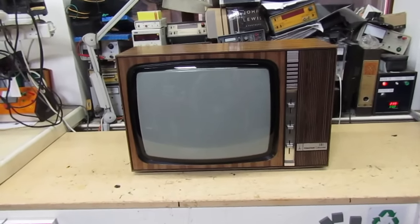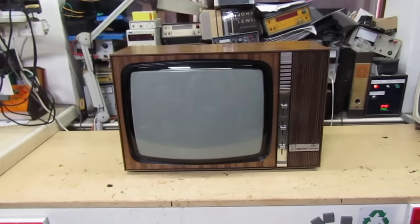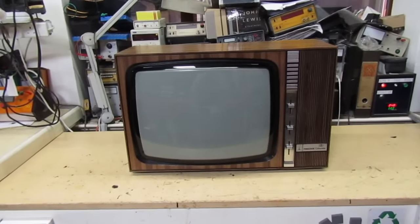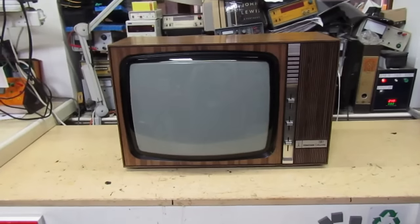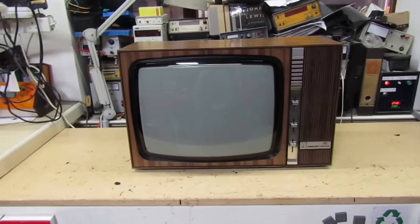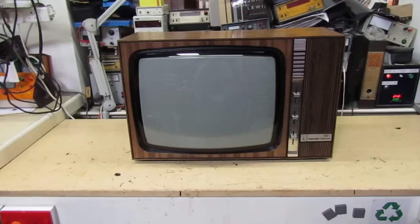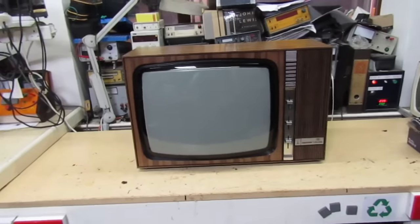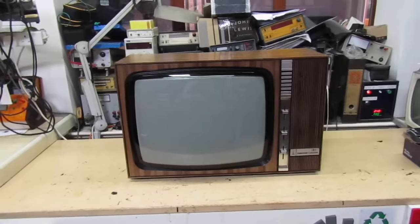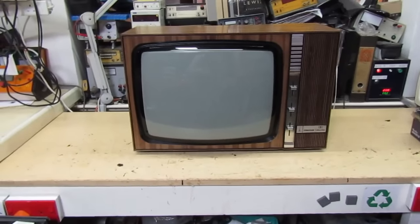This is a set that brings back quite a lot of memories for me - it's the Thorn 9000 chassis. I actually remember the first one of these I repaired and the very last one. The first one I repaired was in 1984; I'd recently left my job at the electrical retailers and set up on my own doing TV repairs. The next door neighbour came round and his Thorn had a tripler fault - it was arcing to chassis. It turned out to be a high voltage bleeder block connected to the tripler, screwed onto the metal chassis, contributing to the breakdown.